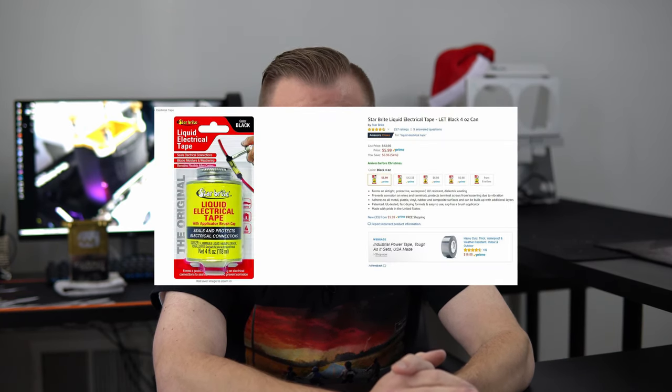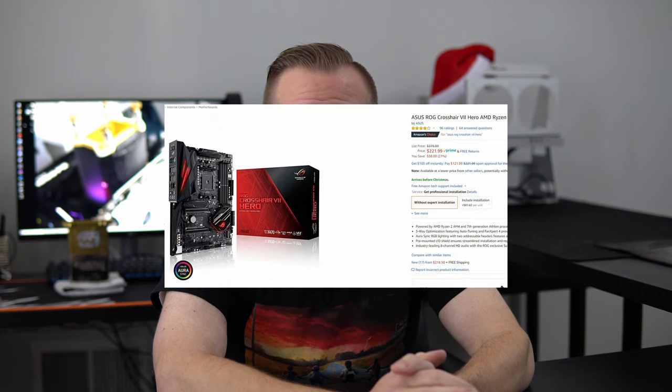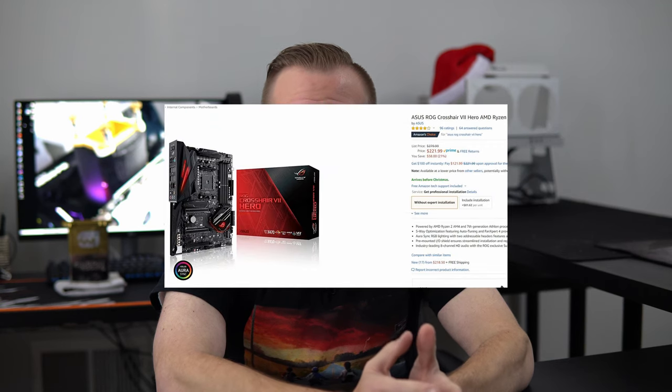Liquid tape is far cheaper than replacing motherboards, and liquid tape does not hurt motherboards. So what we took away from this is liquid tape more of the motherboard, especially when we're doing dry ice overclocking, where it is notorious for the pot bubbling over and you end up with acetone on everything. So that's what we took away from this one.